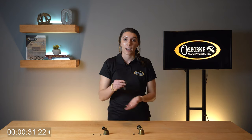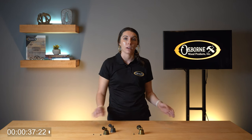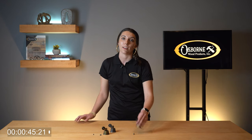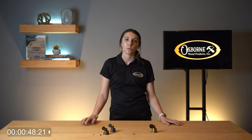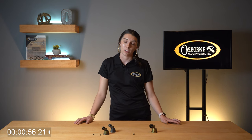We have two cup casters available in different metal finishes to choose from. Brass cup caster part 942 on our website has a height of 2 3/8 inches. The cup itself has a 1.5 inch diameter at the top that tapers down to a 1 inch diameter at the bottom with a height of 1 inch. We also have a slightly larger version, part 947, which has a polished exterior. Both of these come with attachment screws allowing them to easily be installed to furniture legs that have been milled to fit inside the cup. Please remember that the caster will add additional height to the furniture.